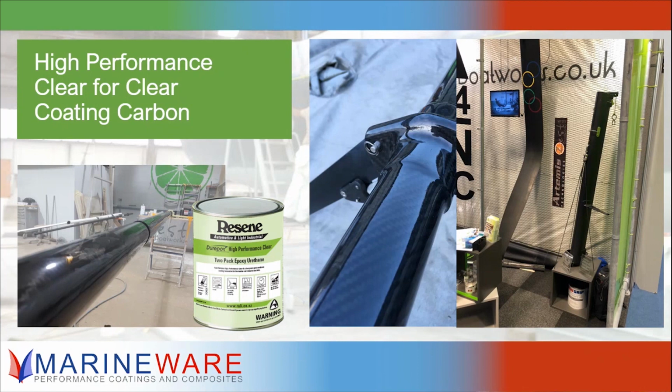Any tips you're willing to give up to us, Pete? Do you use it to get rid of the old pinholes in carbon? It's always everybody's plague. We've had a couple of the molded masts, rather than the filament wound type masts that use a shrink tape, that have had pinholes. So all we've ever done is just brush on a couple of coats and flat it back, and then spray the final coat to give you a nice finish. Doesn't shrink too much into the pinholes, but if you do leave it a few days, it just does its little bit of shrinking, and you can just ferret it all out.